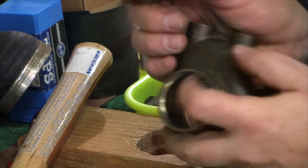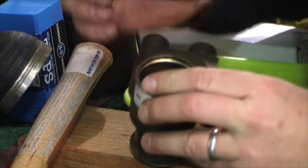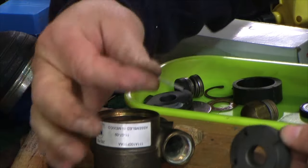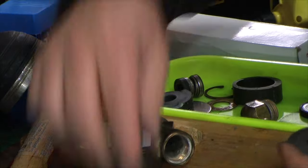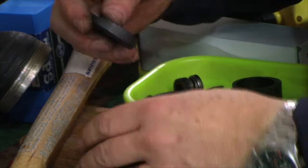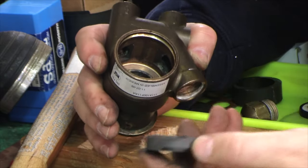The hard part now is trying to figure out where in the pump this goes. One of the nice things is we have this line right at the top — that's where our pin is going to go. We have the pin that's going to drop into the top of that. We'll use the new pin from the kit. Before we put the pin in, we'll want to orient this bearing plate the correct way.